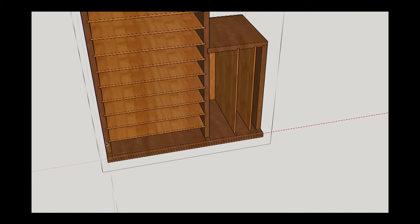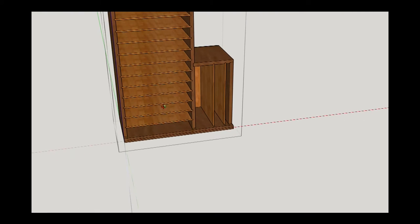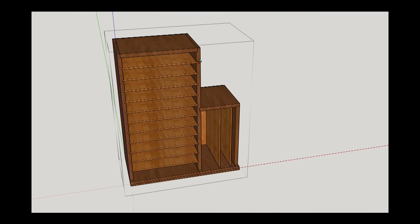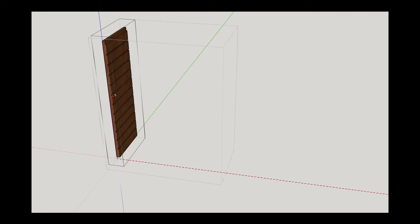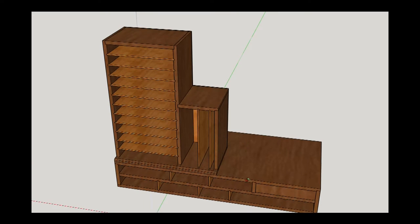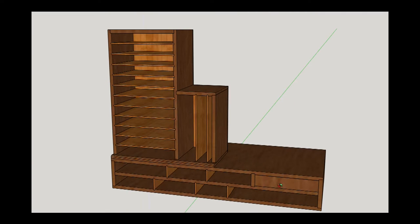These parts here, the sides, I'm going to delay cutting. I'll lay out these parts side by side and then I'll cut them oversize, put in the grooves for the edges, so that I'll put all these in with both panels together, and then once I've done the grooves I'll cut the panel in half, trim them down to size, that way the grooves should match. I mean, to some woodworkers out there, this seems like a really easy build.